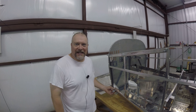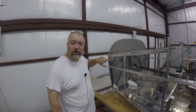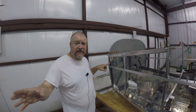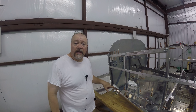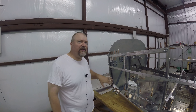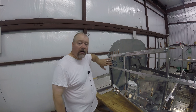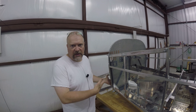I might do the rest of the plane at 90 degrees. But I did have to cut a little channel — a little access, if you will — in the flange of this part. The plans specifically say that's okay. I did it again down here so I can get access to yet another hole. That's something you're going to have to do, and it's not painful to do it when it's on the plane. It would obviously be easier to do before you put all these parts onto the firewall forward, but it's not a big deal — you can totally do it here. Just Dremel.